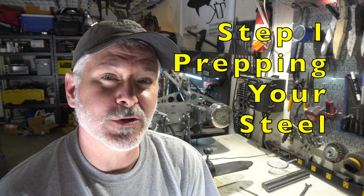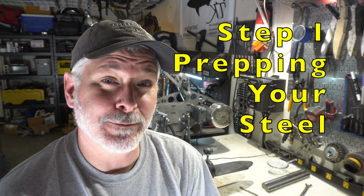Step 1 to a good forge weld is prep work. Yep, that means before you even start, you need to prep your material. So first off, not all steels like to forge weld. There's certain steels like 5160 does not like to forge weld to itself. So be aware of what you're trying to forge weld to.